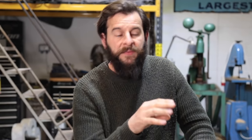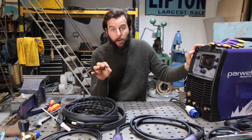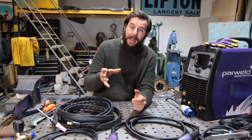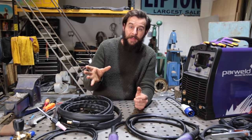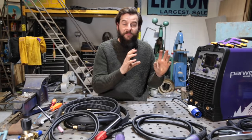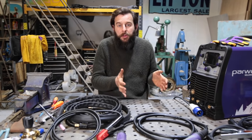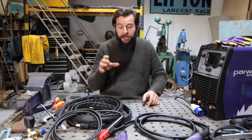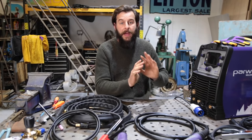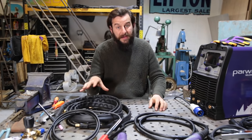If you're making furniture and welding bits of iron, angle iron, box section and thicker material together, a MIG welder would work well for that. If you've got a classic car and you want to start welding repair panels into very thin sheet metal, I would suggest a TIG welder. The MIG and TIG processes do require a gas bottle. If you're in the middle of nowhere with no access to gas, then stick welding may be your option - it's very basic, portable, and you don't need any gas. You just need the machine, the holder, and the welding rod. You can get a neater weld with MIG and particularly TIG.